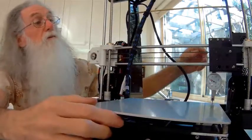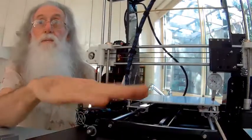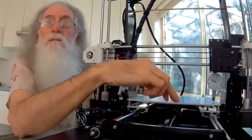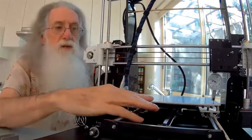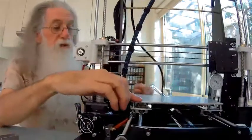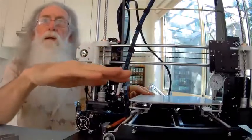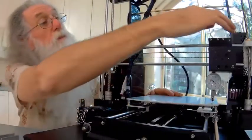And then you come to the front one, and that still can be up and down. Now that might be higher, lower. So what that means is you haven't got a perfectly flat table surface. So what you might have to do is have this at 0, 0, or 1 and 1, 2 and 2. So you try to level it out the best you can get. Then you come in the middle.